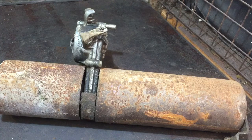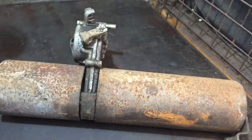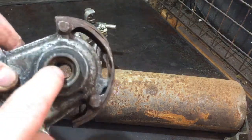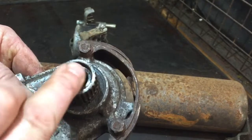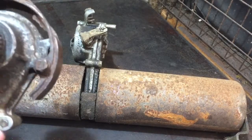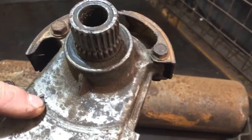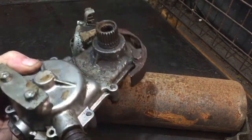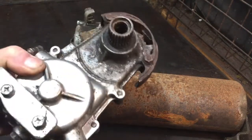I've had people ask how do you get the roller off if it's stuck on them — I've really only found brute force. You could use heat, but then you're going to heat up the oil seals and the roller bearings, so there's potential damage you could do and they're not easy to change. The bearings look okay in this one actually, but you can see the rollers have been digging in there. I'm not sure whether that's because this is a gearbox off a different machine — a Lawn Flight — so there might be slight differences.